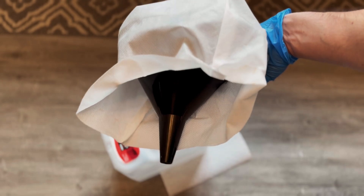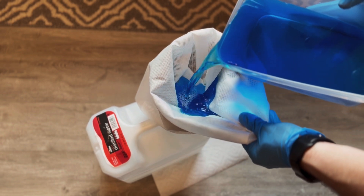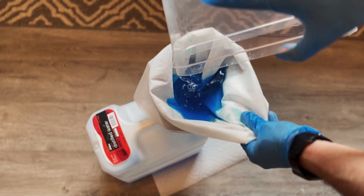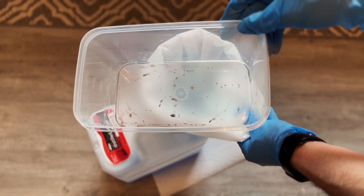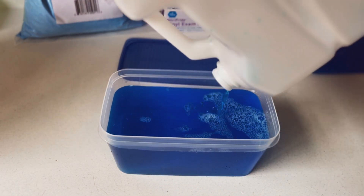At this point the solution is done, but I highly recommend filtering it before using it. I used copper sulfate crystals from Amazon and noticed some imperfections in my solution — I'm not 100% sure if this was caused by small impurities in those crystals, but that would be my best guess. If you purchase your crystals directly from Caswell you might not experience this issue, but I still recommend filtering the solution regardless — it's just best practice. To filter the solution I use a funnel, large coffee filters, and a sheet of polypropylene. I pour the solution into the funnel and it drains by gravity into a 2.5-gallon container, effectively removing all impurities. When cleaning large amounts of solution I usually have to do it in batches, but it's well worth it to get shiny electroplated parts.